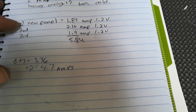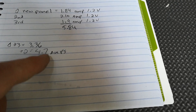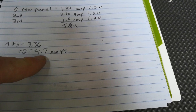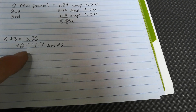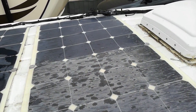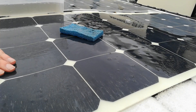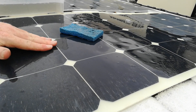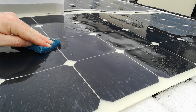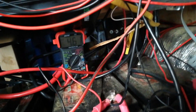I measured all the panels individually. The first panel is my new panel, the second is the middle one, and the third is the one in the back. When I plug them all in, I get 4.7 amps — that could be fluctuating because of the cloudy skies. But really, you're supposed to be getting that for one panel alone, so these are incredibly inefficient. I decided to wash the panels to see what difference it makes. I can see one cleaned side versus one uncleaned side — it's a lot rougher on the dirty side. I think there's some plastic coating that degraded in the sun, and I'm scraping that off with a slightly abrasive pad. But after cleaning, it's still at 4.6 amps.